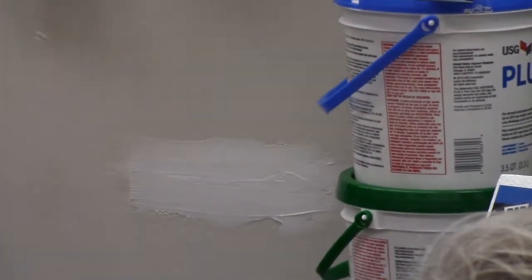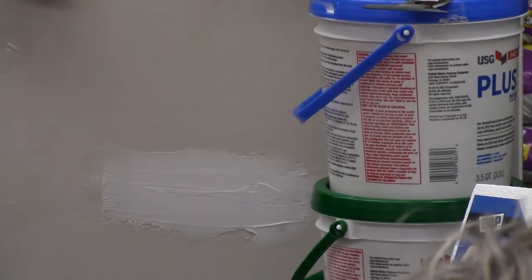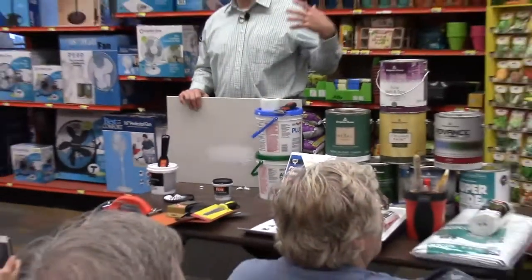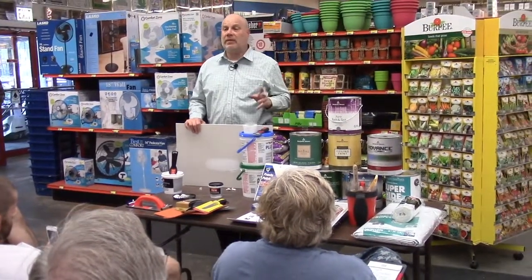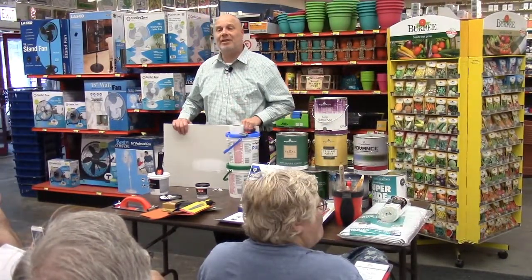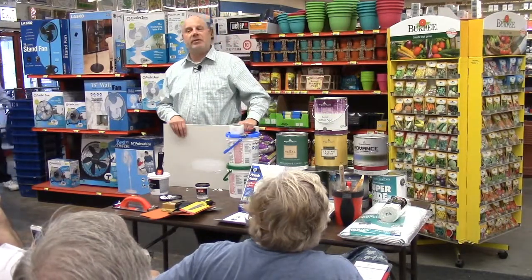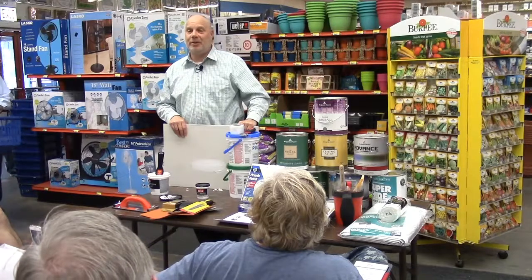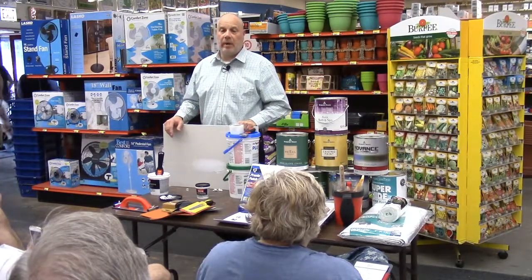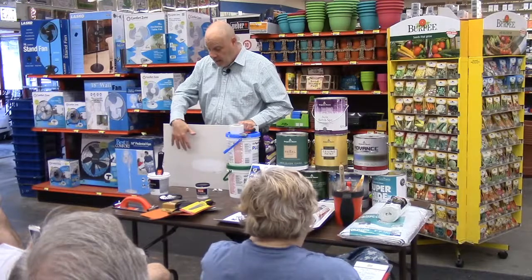Something this size or larger, between two sheets of drywall, normally takes three to four coats to get as smooth as you'd like. Keep in mind that when you do a repair over an existing wall, the wall may have had multiple coats of paint giving it a little texture. You're putting a smooth coat on and sanding it smooth, so you could notice a texture difference. Residentially, wall coverings like wallpaper have fallen out of favor because when you want to change them, you have to remove the paper, prime and seal it very well, and rushing that process can cause blisters and drying issues.